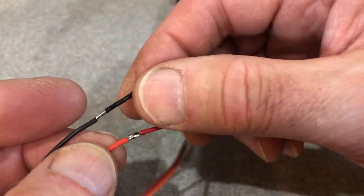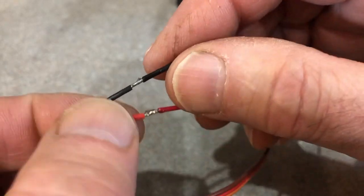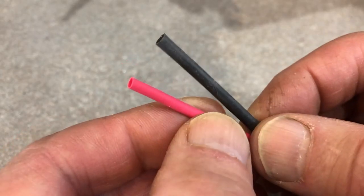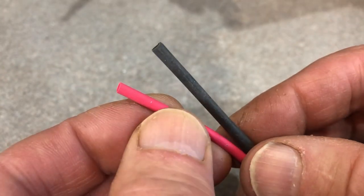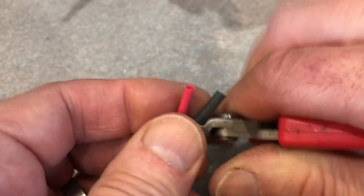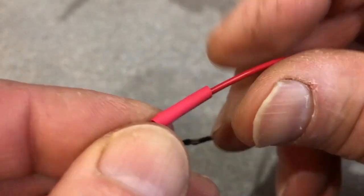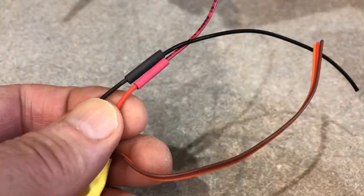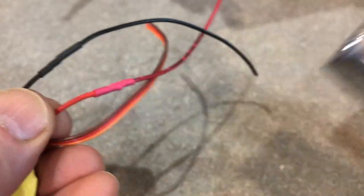Now these two wires are going to be plugged into a LiPo battery, so having two exposed wires touching each other is extremely dangerous and will eventually cause the LiPo battery to explode and cause a fire, possibly burning down my house. So I want to insulate these wires in a professional manner. We'll insulate the wire with heat shrink tubing. I have a whole selection of this stuff ranging from a diameter smaller than this all the way up to about half an inch. Cut off about a half inch of each piece, thread it down the wire and over the solder joint. At this stage you can use a soldering iron to shrink the heat shrink onto the wire, but a much better solution is to use a heat gun.